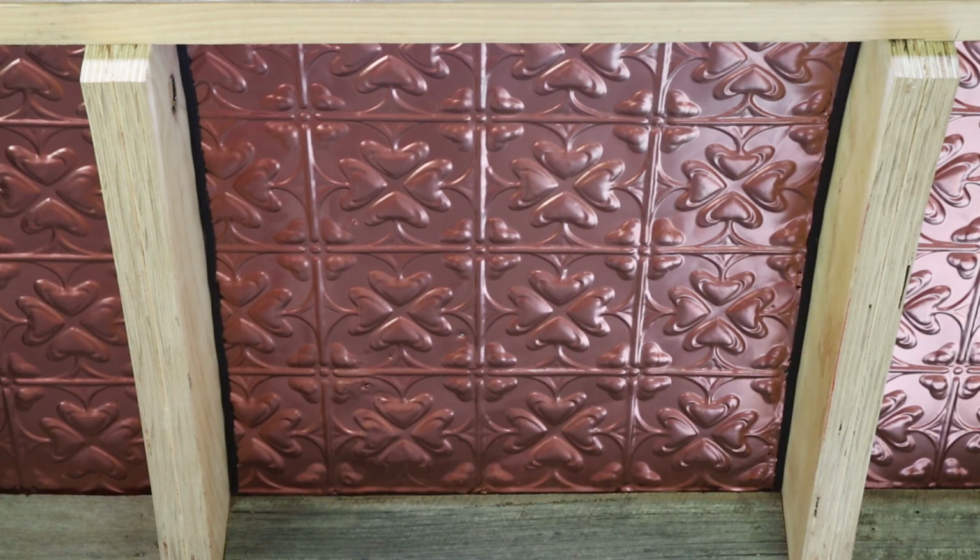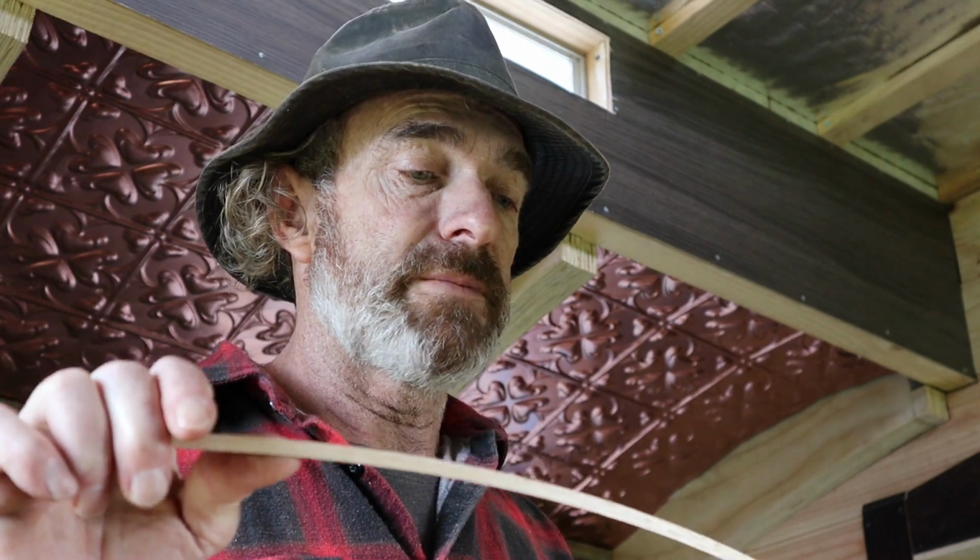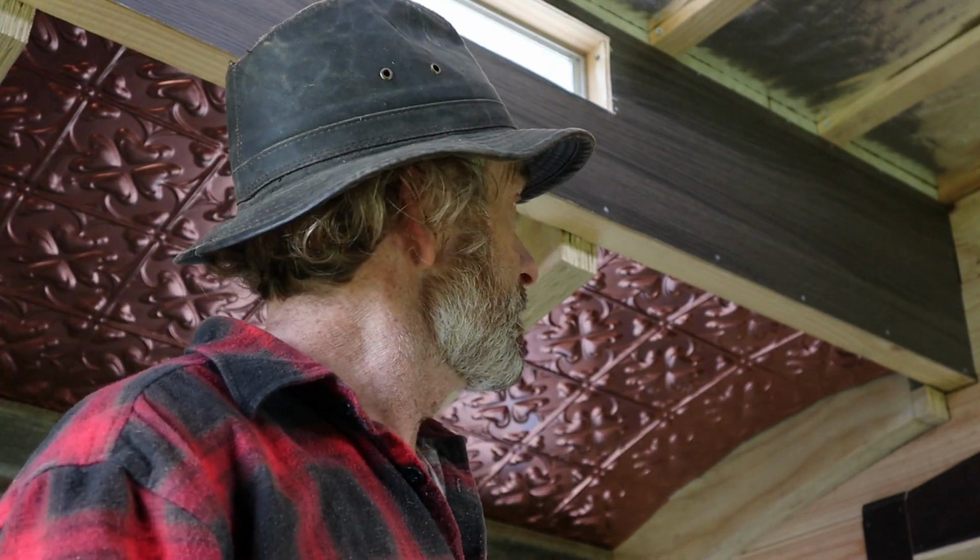If you can see, I had a piece up there with this running down either side. It's black. In the first bay I spray painted it the copper colour, but the same problem. So a simple quad can be nailed on the bend. This one's too small. I had this lying around and this is far too small, so I'm going to get like a 15mm piece of quad maybe. I don't want to go too wide because that'll make it hard to flex, but when you whack it up there and nail it off to the beams, it sends the sheet on a curve.